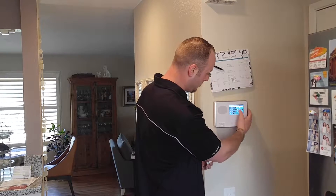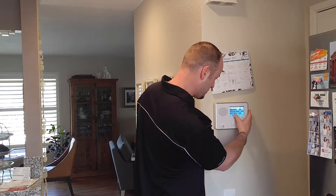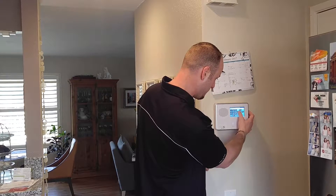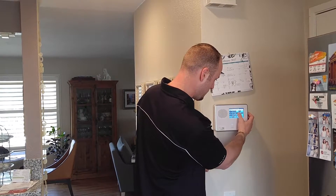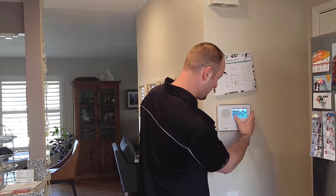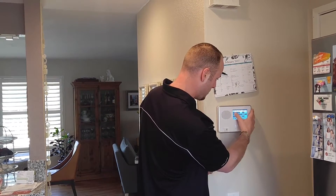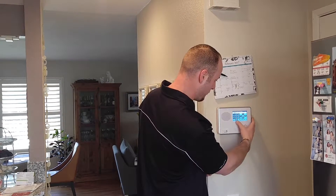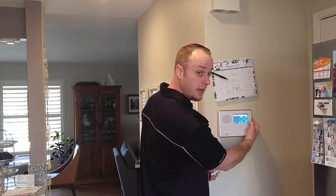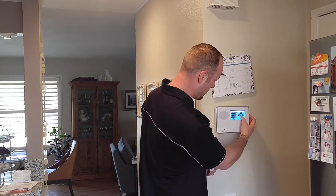It's going to be in the dining room, so we're going to hit Insert — 133. Go to the dining room. Then insert again — 187 for room, then insert 251 for window. Now it says 'dining room window' on our keypad, which is what we want.